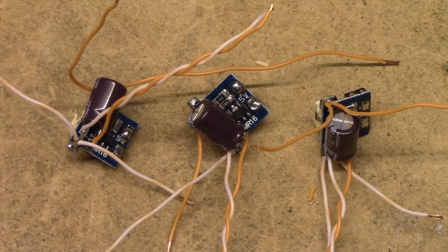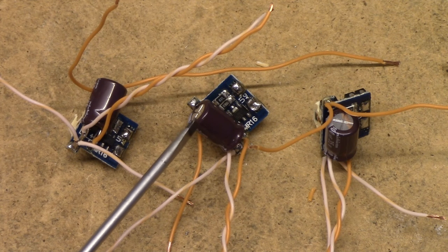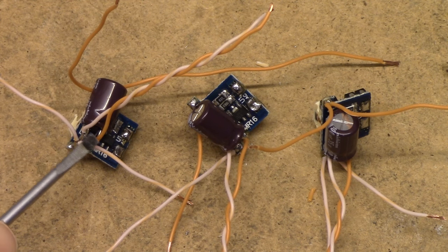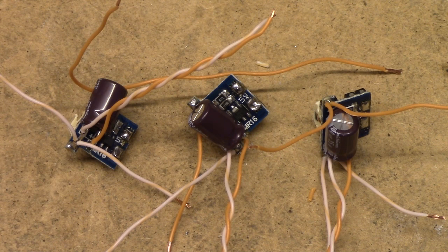Here's a shot of the finished modified LED drivers. The mods don't really add up to much — I've replaced the original 220 microfarad 25-volt capacitor with a 100 microfarad 35-volt cap, to enable proper 24-volt use. It also doesn't need the 220 microfarad anymore since I don't plan on running these on AC, which is quite obvious since I've installed a power inlet cable straight across the input capacitor. So these are definitely not AC capable anymore. I'm going to leave the diodes sitting on the board still though, since they just make the board a bit more sturdy and provide more area for the adhesive to adhere to.